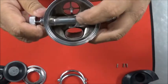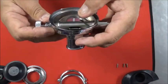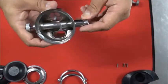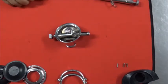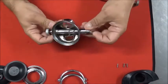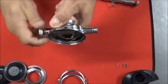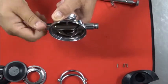And then you can move your demand lever, and you'll know when it's right because it'll spring back and forth and it will feel correct. That's the hardest part to this whole operation. Now, before we put the cover and things on, I'm going to show you what the relationship is between the adjustment knob and the adjustable volcano orifice on this. If you notice, with the adjustment knob, I can turn the adjustment knob all the way down till it stops, and the lever height never changes.